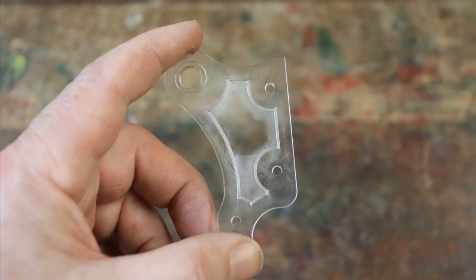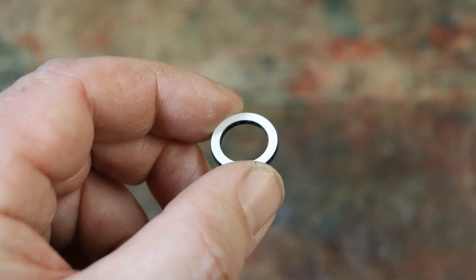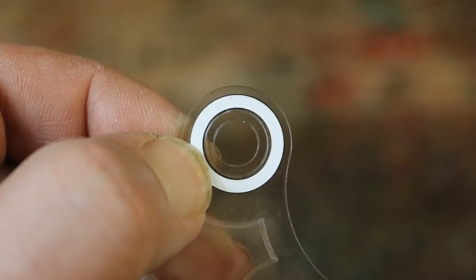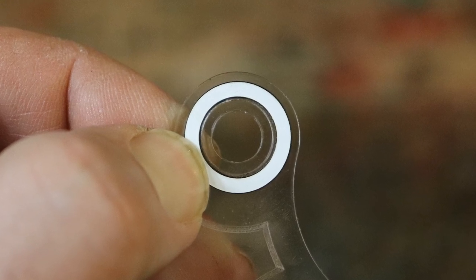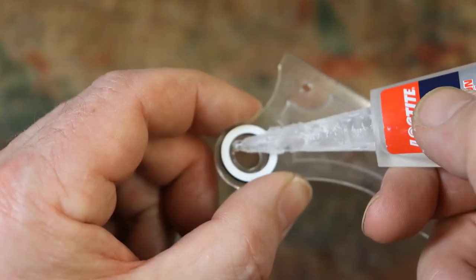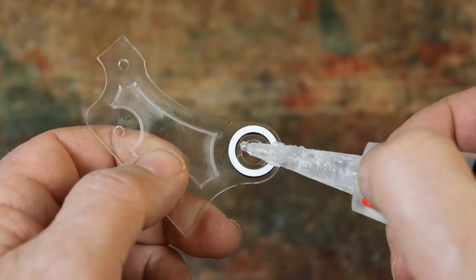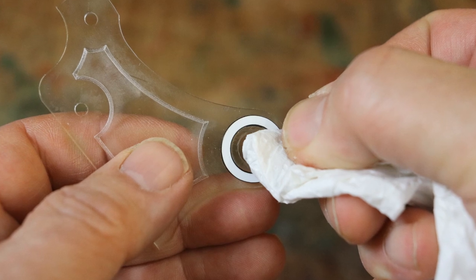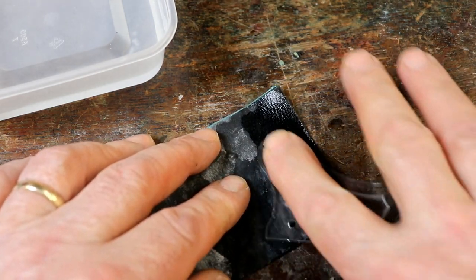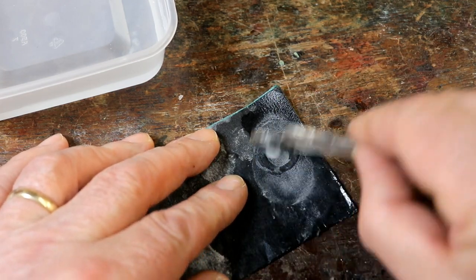Find the engraved gem panel and the remaining black and white ring. From the front, the engraved side, line up the middle of the ring with the engraved circle in the panel. Once you have the ring and hole centred, place about three drops of super glue around the inside of the ring. Capillary action should draw it into the joint. Wipe off any excess glue with a tissue. If you do get some glue on the fronts of the panels it may show up once they are painted, so use the wet and dry abrasive paper and some water to sand off any glue.